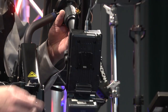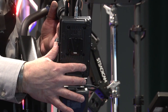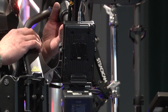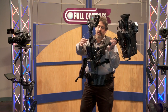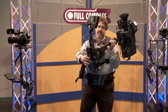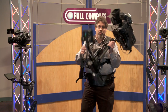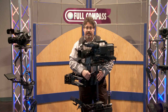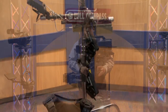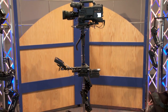Something our customers have asked for is the ability to have 24 volts or 12-volt hot swap on a Zephyr. This is the accessory 12 or 24-volt battery mount. It slides on the bottom, plugs into the Zephyr, and provides the option of 12 volts — hot swappable between the two — or 24 volts for a lighter weight film camera. Hot swappable means when you're running a camera like a RED, for example, you can change one battery and not kill the camera's power.